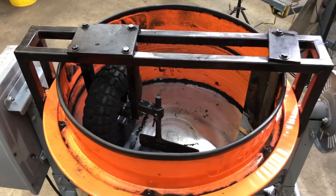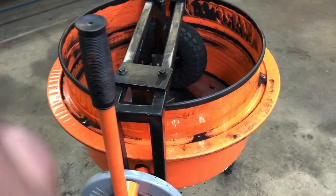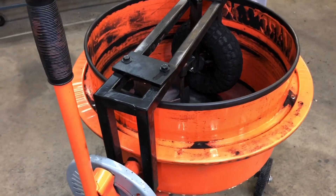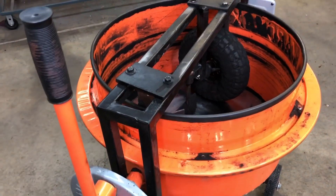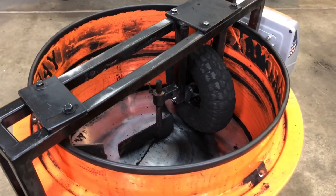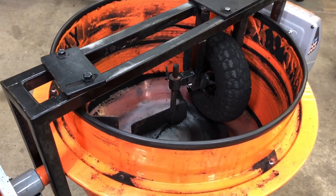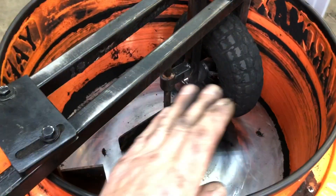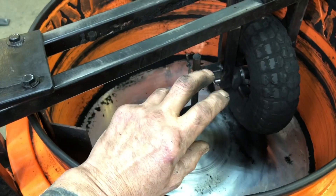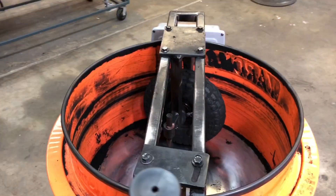So honestly, in a nutshell, that is your sand muller. You need to have one of these if you're going to be doing hobbyist castings, because what happens to your sand is it dries out — it loses its compactability, and you're going to get majorly frustrated with your molds because they won't stick. So you have to have something to mix in that two-stroke motor oil. That's the key ingredient with Petrobond — this two-stroke motor oil. And it doesn't take much, and you can see that in the video.